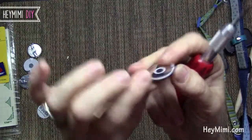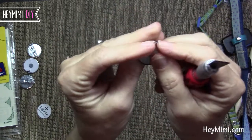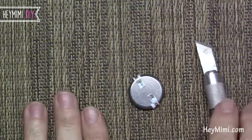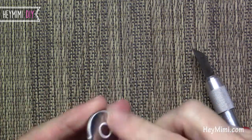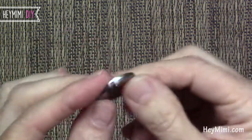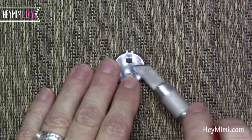There's a little jacket around here that's changing the polarity — it's making the back side the positive side. And I found that the key is to try very hard not to bend this little disc, because when you put it on the new battery, you want these all to be as flat as possible so that it's making contact with the new battery.